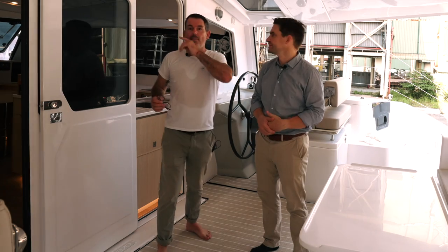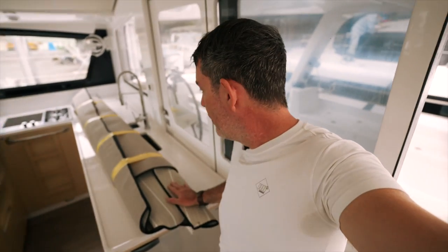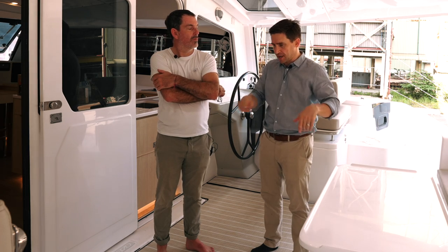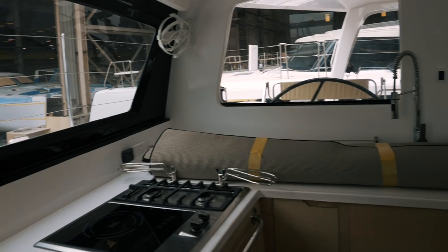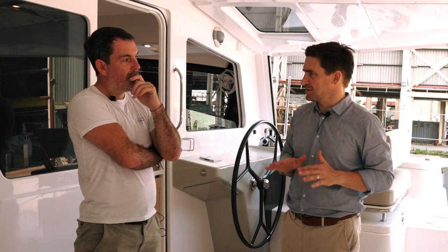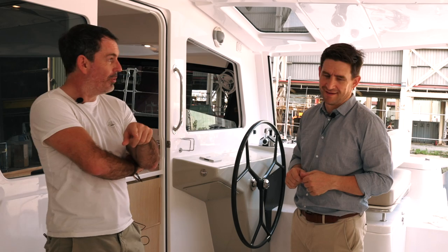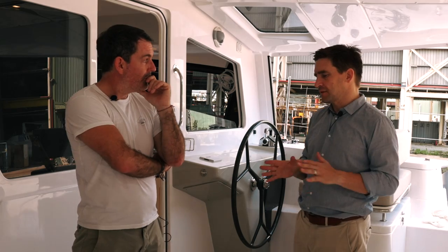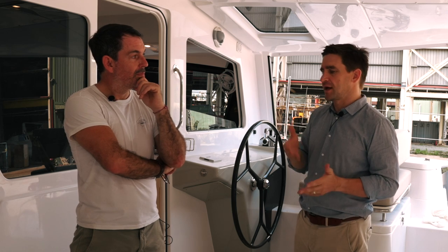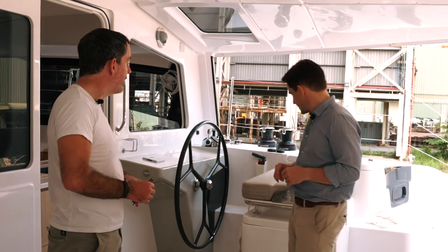Let's get up and look at the cockpit. Talk about this floor matting — it's infinity vinyl flooring, a foam-backed vinyl floor, actually beautiful underfoot, nice and soft. You've still got the non-skid underneath, and it's a cut-to-shape vinyl flooring press-studded around it, so you can peel it off and take it off the boat. Whereas with a flexi-teak surface you grind off all the non-skid and bond it down, making it much more permanent. You can jet-wash the vinyl — so if you spill red wine on it, we can jet-wash it out. It only weighs about 20 kilos. Flexi-teak looks aesthetically fantastic but does retain heat, so for hotter climate boats this is probably better as it's nice and cool underfoot. The addition of these locking pins is a very clever idea. We've got these reversible seats as well.